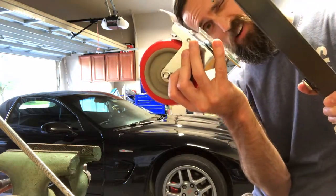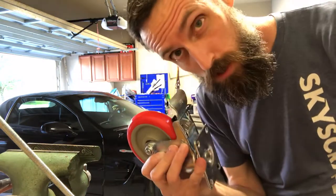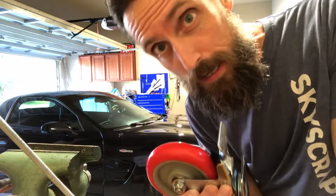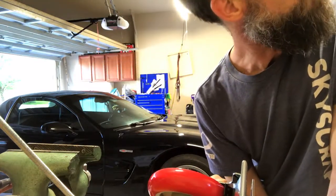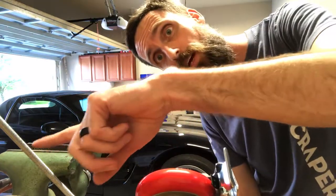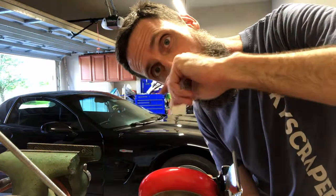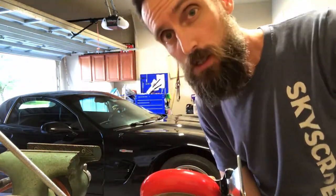I don't have much room there. So I'm going to do some measuring, heating, and cutting. But I've got to find some nuts that I can put on the all-thread, because I don't have a tap and die set for this type of all-thread. So I'm just going to put some nuts on, and when I cut them off, just unscrew them. Be good to go.